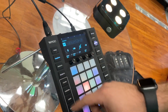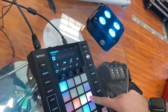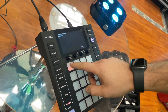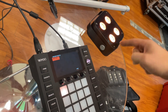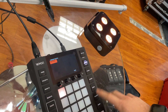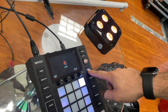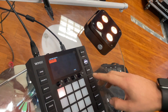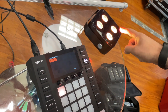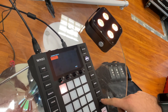Every time I click this button, the lights will go to candlelight, even if we're on an effect. We're on an effect right here — it's jumping through a whole bunch of stuff. I want to go to live edit and hit candlelight; it's going to override everything else. But here's what it won't do: if I hit blackout, my lights still black out because we didn't change the dimmer value. If I hit strobe, they can still strobe because we didn't change the shutter value. We only changed the color values, not the dimmer and not the shutter. So all of our overrides still work.